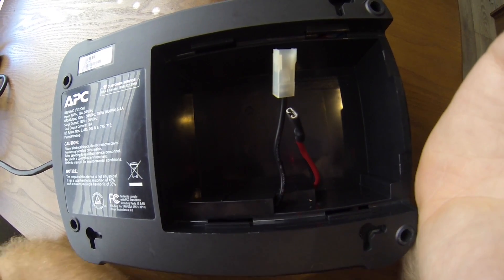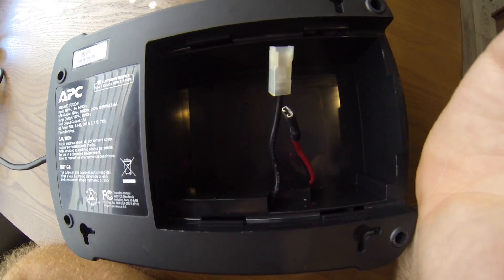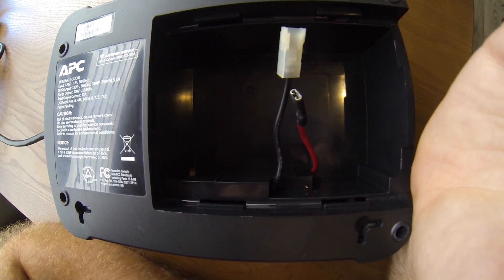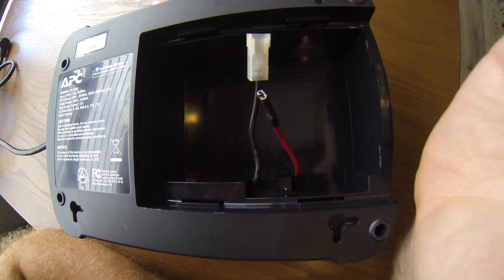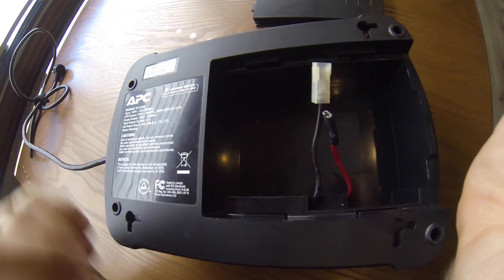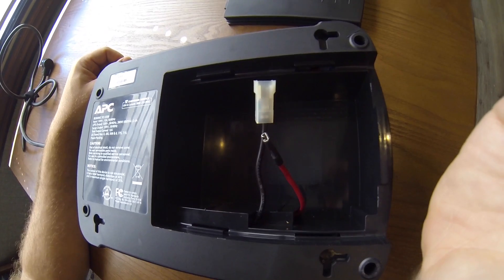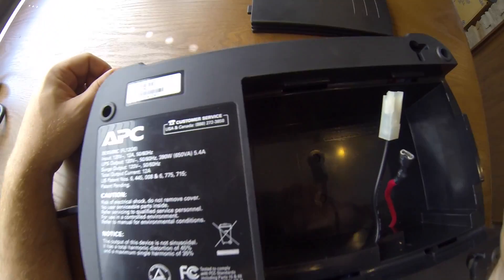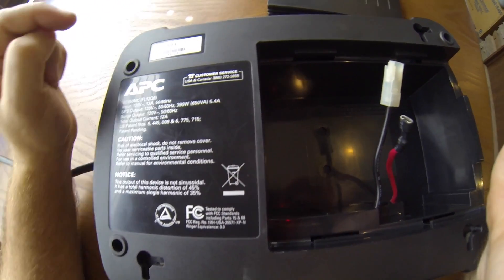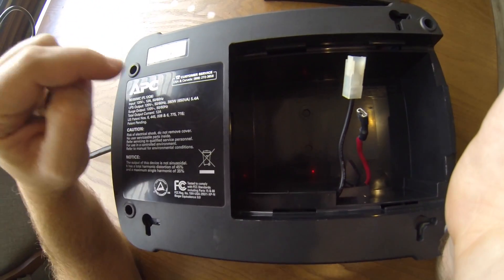You don't want to do that if you're trying to pull 50 amps. 12 gauge cable can do probably 20 amps pretty easily, and can probably do 30 amps over a little longer run, but not 50 amps. So if I want to do 50 amps, I'm going to have to use like an 8 gauge cable, which I do not have installed and do not really care to do, because 8 gauge cable is a pain to work with. So I'm still using my 12 gauge cable.